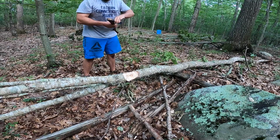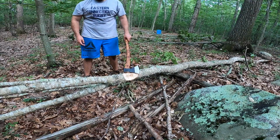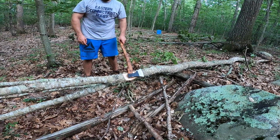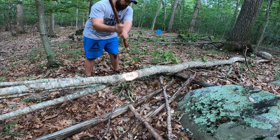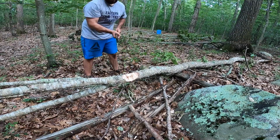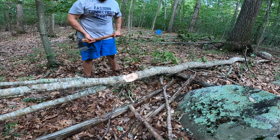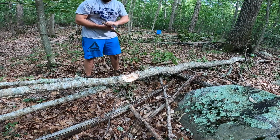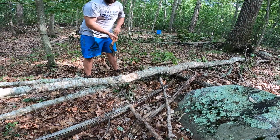Also, one thing I learned by watching, there's a Scandinavian guy. He used an axe, maybe the blade was about the same, but it was probably about half the weight of this, and he chopped a tree that was probably 3 feet thick, and he just did it slowly, but he focused on his cuts. He was very methodical with the placement of his cuts and made sure each cut was exactly where he wanted it. He was taking out large chunks of wood. And what you could do is cut, and if your axe gets stuck, lever it out. I don't like doing that because I think it loosens up the head, so I just stick with fast, light cuts that are accurate.